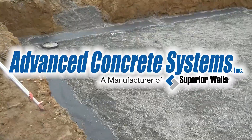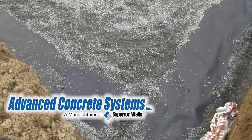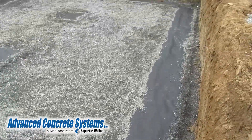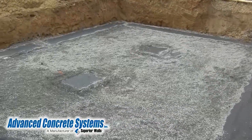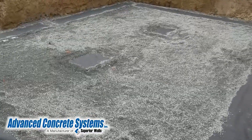Site preparation for winter sets takes extra preparation to ensure your crushed stone is free of frost. This video is to demonstrate those steps. First, keep in mind: do not excavate the site too far in advance of the scheduled set date, and do not place footing on frozen soil.